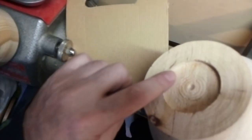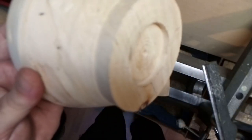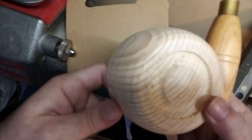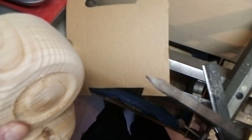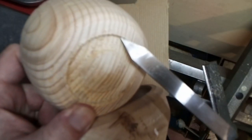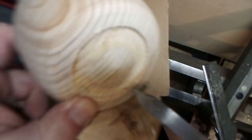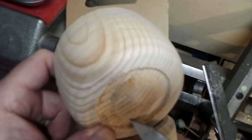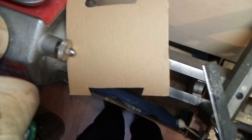Make sure they are very clean. Especially in soft woods — in hard woods it is very easy to achieve. But in soft woods you cannot just hold the gouge still for a moment and pull it out, because then it comes out dirty. If you noticed in the first video, in the first sequence, I spent a while with the gouge still so it would clean well — because the end grain and the side grain are not the same. In very soft woods it is very noticeable — we end up with dirty recesses where the piece grips irregularly.